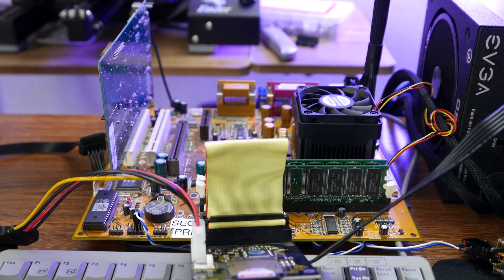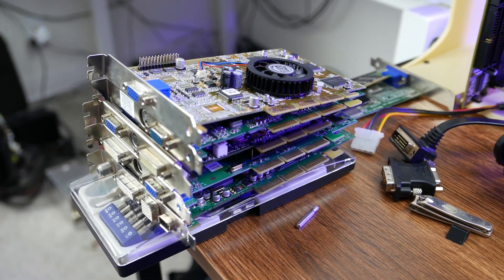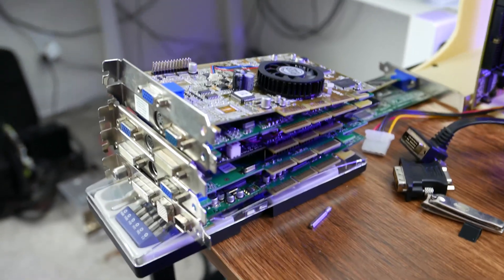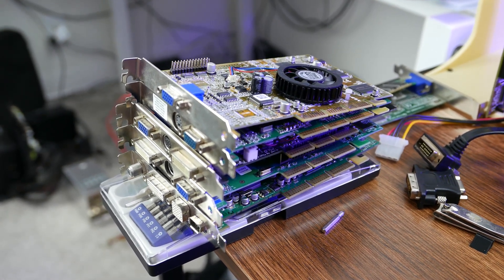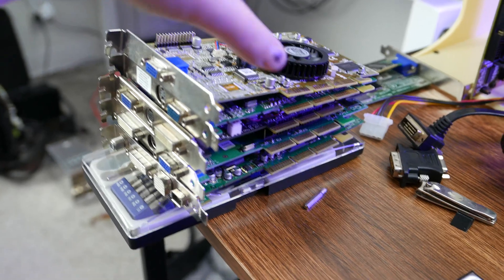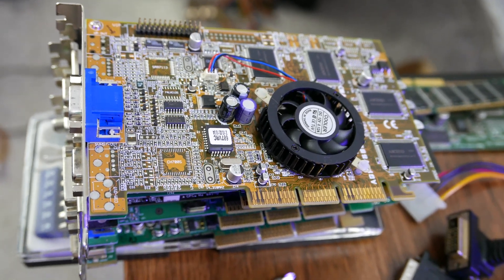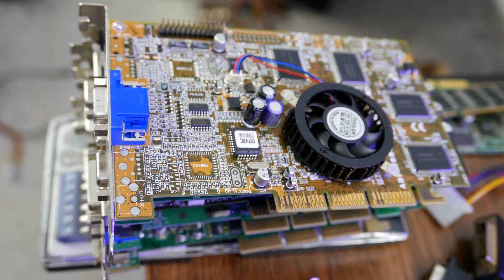What I did end up doing though is I started installing graphics cards to see what would work with this Universal AGP slot. Because if you know anything about Universal AGP, it's usually far from universal. Most of these cards are in a don't-work pile. Pretty much any AGP 4X NVIDIA card seems to work just fine. The Vanta worked fine — that's what I started with. Also my TNT2 Ultra worked fine. My GeForce 2 MX worked perfectly fine. And this lovely donation from PixelPipes — a GeForce 256 DDR — also worked just fine in the board and was very fast.